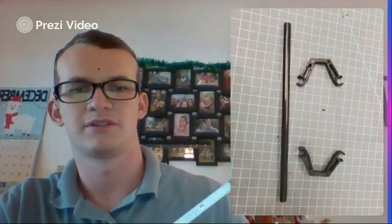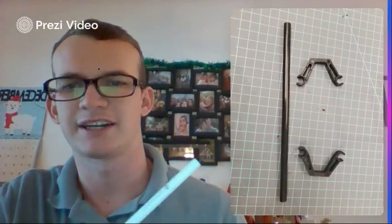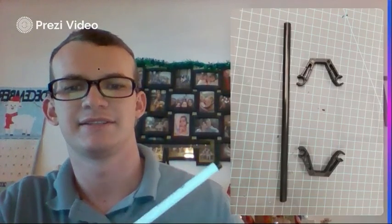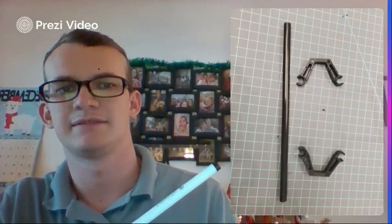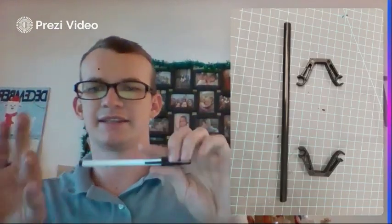All right, so now we're going to proceed to another piece of the drone. You're going to want those vertical arms, the pylons I call them, and the V-frame plastic pieces. These two actually attach together, and you can clip them into the V-frame. I would recommend sliding them, however. While they both work, clipping them has a chance to break the plastic on that V-frame attaching bracket. So I would recommend taking the black pylon and sliding it through the V-frame there, like so, not clipping it in, as that risks damaging your parts, and that would just suck.